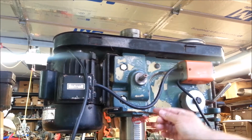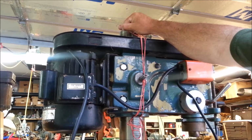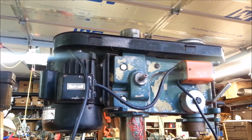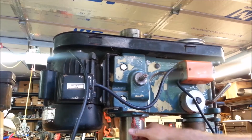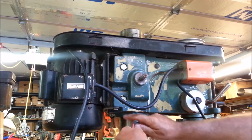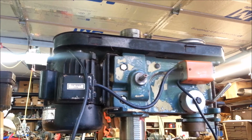So what I did was I took a bunch of rubber bands and went around the outside of the mill and captured the rack on both sides, with the idea being that I can cut these rubber bands away and hopefully get them out of there. I know I can get them out of there, once we had the mill up. A big handful of rubber bands is a great thing to have around the shop for jigging things like that.